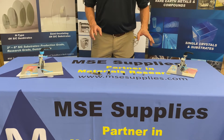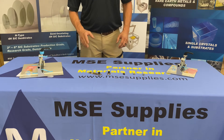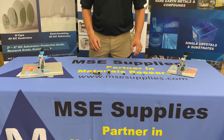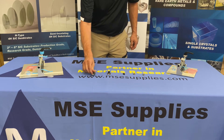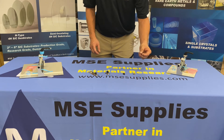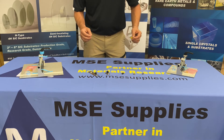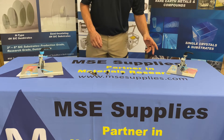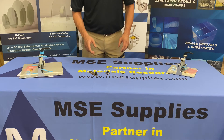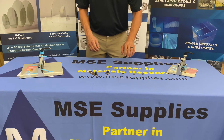We offer several sizes of the Utile precision cutters — this is the 100 millimeter substrate cutter, 200 millimeter, and we offer all the way up to 500 millimeter substrate cutters. You do need to purchase separately magnetic substrate holders in different sizes and the different cutting wheels. We have carbide cutting wheels and diamond cutting wheels. The different cutting wheels are for different thickness substrates, such as 0.5 to 1.3 millimeters. We can go all the way down to 0.05 and all the way up to 3 millimeters, so depending on what you're trying to cut and the thickness of the material, you will have to choose which cutting wheel makes sense for you.